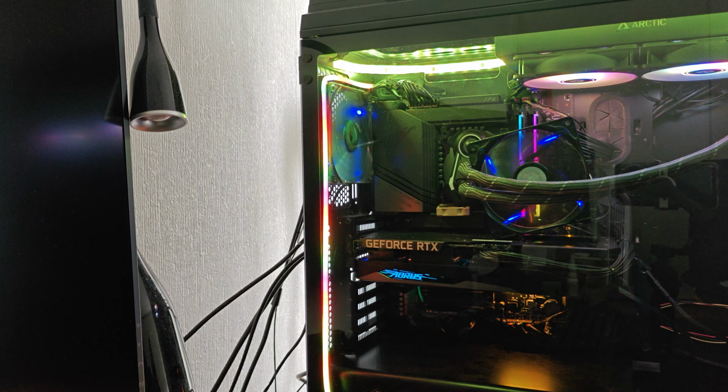But what I think is that Gigabyte did something in the BIOS which completely messed up the IMC on my CPU. Because on an F5 BIOS, it works perfectly fine. So if this doesn't work, I just go back to the F5 BIOS and forget it. It's just not worth it. Wait, I hear a pop noise from the speakers. Maybe it boots. Does it boot? No, I don't think it's going to boot.